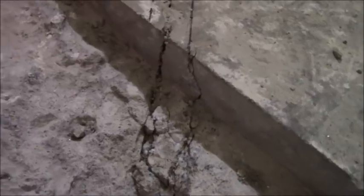I'm usually going down more or less about 1.75 to 2 inches. I think this is 2 inches, or it will be. Most of it will be about 2 inches by the time I knock off all of this high spot. And then eventually it has a nice smooth slope going down. Well, it's not now because I haven't done any mortar work. But what you're going to do is get a level.